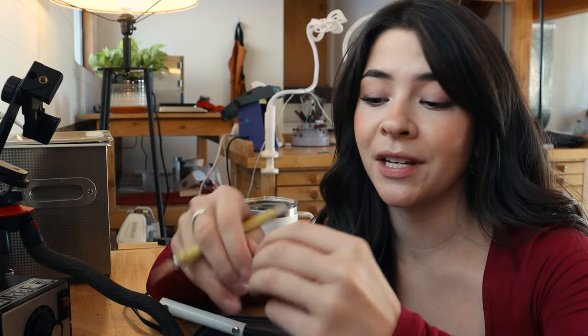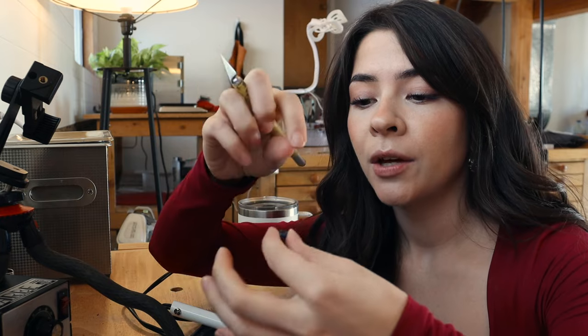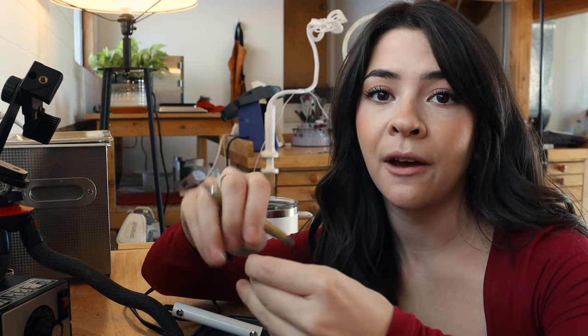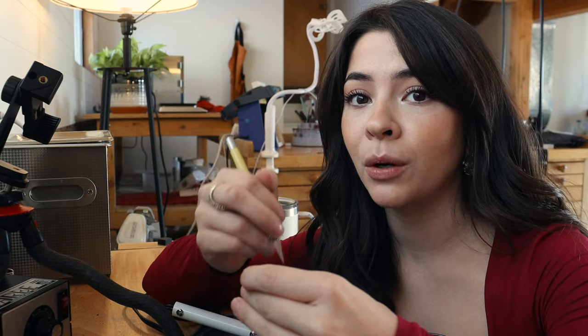I wanna try, but I've never done it. Unless you're casting your stone in place, you wanna make sure that you can easily take your stone out and put it back in. So before you cast your piece, make sure that you can easily put your stone in without having to force it or wiggle it, because your wax will give when you pull your stone out, but your metal won't. It'll also give when you put your stone in, but your metal won't.